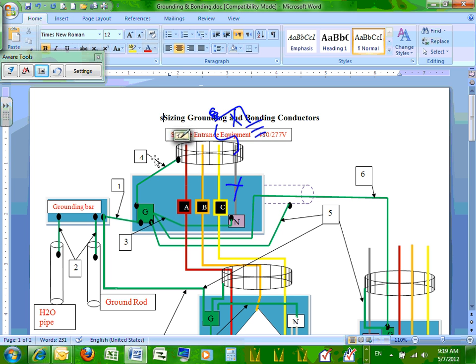So the load will share the voltage based on their impedance. The largest impedance will take the highest amount of voltage. They're in series. You have two loads in series. A 100K resistor drops more voltage than a 10K. The largest impedance load will take the largest voltage; it goes by impedance when you put them in series. Take R1 and R2 and put a voltage. No, when we lose a neutral, they become in series. You're right, in parallel, you're right. In series, it's the opposite. When you lose the neutral, they're in series.